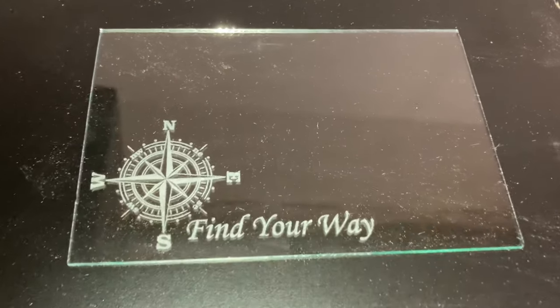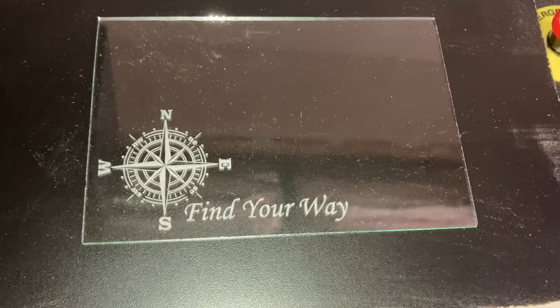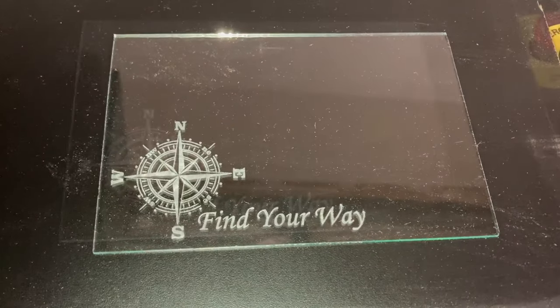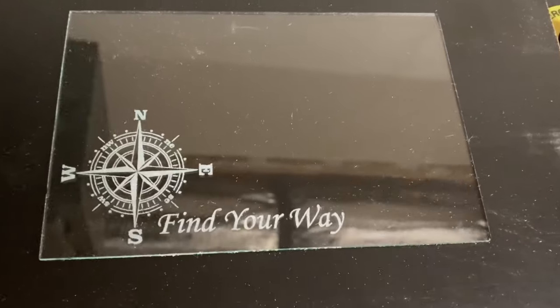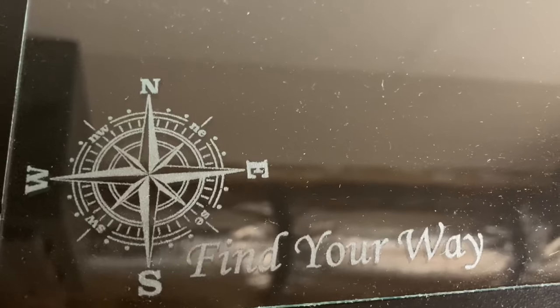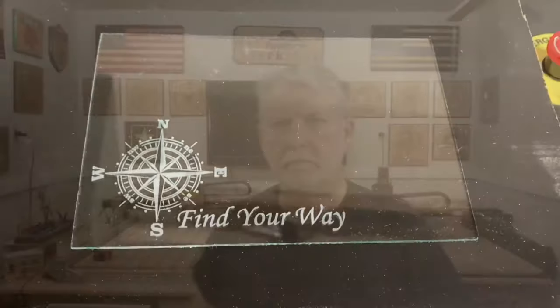Now I'm going to go ahead and take this over to the sink and get it washed up. I think the results of this are fantastic. That first engraving where it was not focused barely made a dent — it did not even remove the paint. That was my fault. So I did not change the setting. Initially I was going to increase the power, but that's not necessary because it did not burn through the paint due to the focus issue. So 30 inches per minute, 60% power, worked extremely well. The other thing I want to point out is that this was with the paint side up, because what you're actually doing is burning through the paint and etching the glass. The paint is there so the laser can interact with the surface — otherwise the laser would go directly through the glass and not do anything at all.